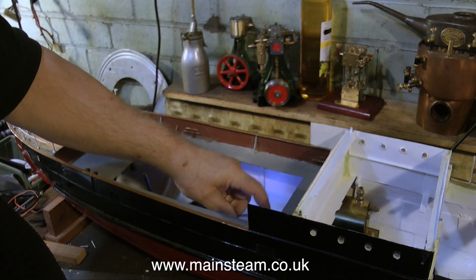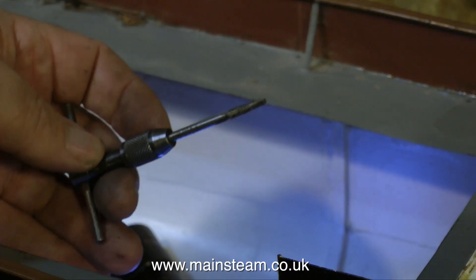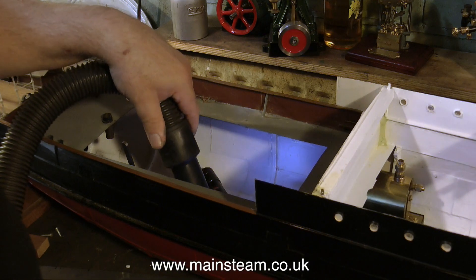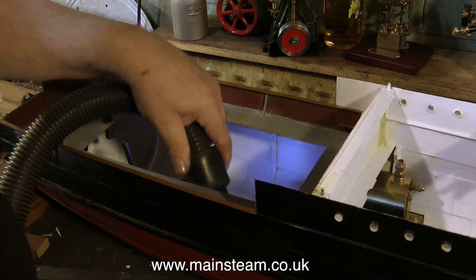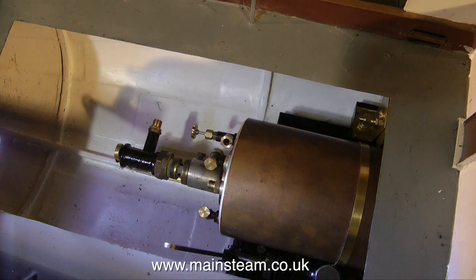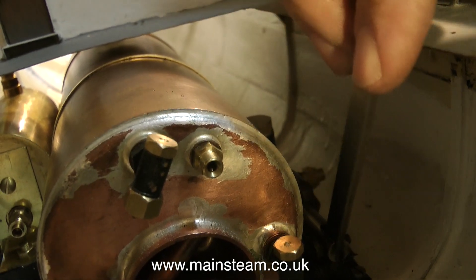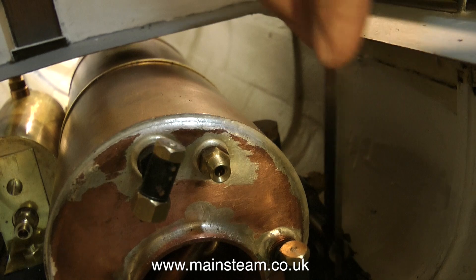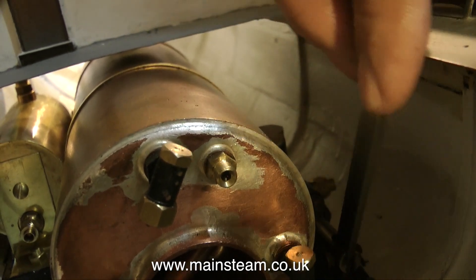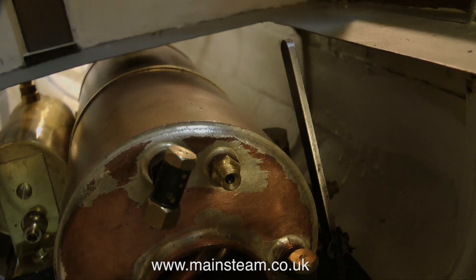After which I tap them 4BA, and these two 4BA bolts hold the back of the pump down onto the bed plate. The final job in this episode was to simply vacuum out all the metal shavings that were in the boat. I'll probably give this yet another coat of paint — the paint has got marked and it's very difficult not to mark it because the boiler is such a tight fit. When I finally finish it I'll put it in ever so carefully. As you can see now, the hand pump is in a perfect position with plenty of room to get your fingers in without burning or cutting them on the side of the metal. Thanks for watching and I hope you found it useful.